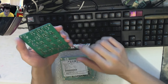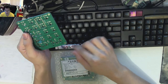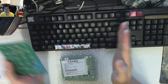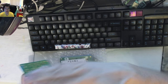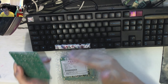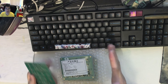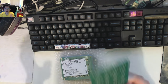The second part to that, though, is if you're using a longer U, like if that hole was not perfect for the space bar, then over the distance of 6U, if it's rotated, that means your space bar is going to be potentially at an angle. And then it's going to be more of a pain because you're going to be twisting the stem, or you have to go and resolder it to try and get it to fit into your stabilizers. So I actually find that to be not very acceptable.